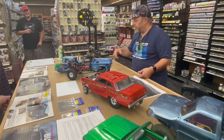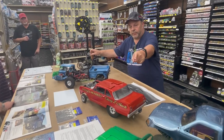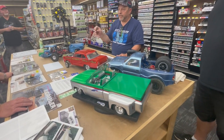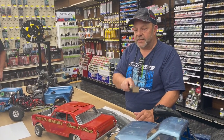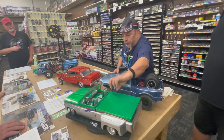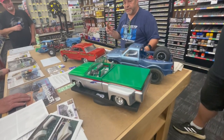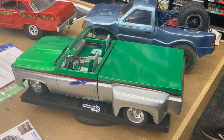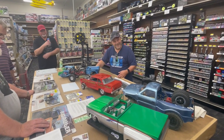My general tool that I use probably every day is just a simple Dremel. Some of the RC four-wheel drive builds that you see, like this one right here, we all know they start from a Blazer. But my favorite tool for cutting up the hard bodies is just this. I rarely use an X-Acto knife. I'll sometimes open the doors on these by dragging an X-Acto knife backwards. But as far as separating the bodies and adding sections, this bed has probably a 3/4 inch section added to it. The body itself was obviously cut so you can separate the bed from it. That was all done with this saw. Bonded that together with MEK and styrene back pieces to kind of fuse the pieces together. Typical knife, you don't have to spend a lot of money. Some X-Acto knives, they have them here too. They also have this, but a different brand.